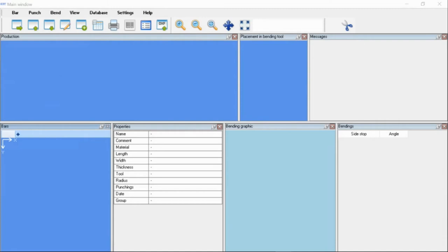We're going to do a length of A of 4 inches, overall length of 12 inches, and a height of 2 inches, with 45 degree bends. On this part, we'll have two bends that are 45 degrees. The radius here, and then also the top radius. 50 is our electronic 2-inch tool, and that marries with quarter inch mandrels or quarter inch radius punches.